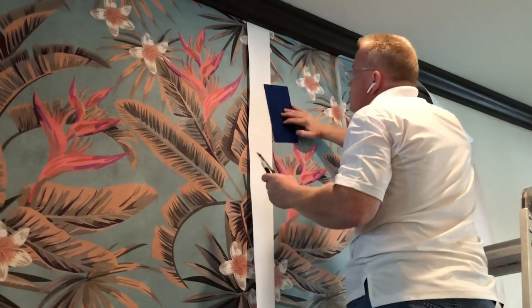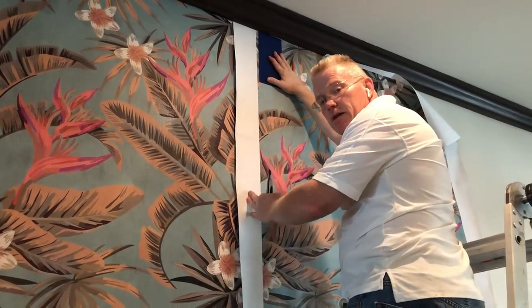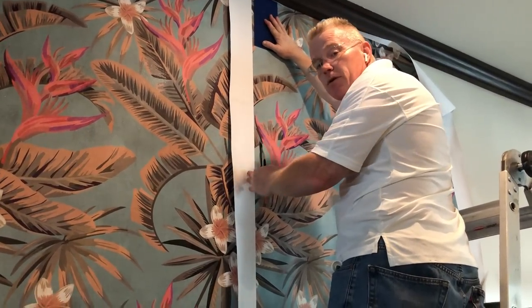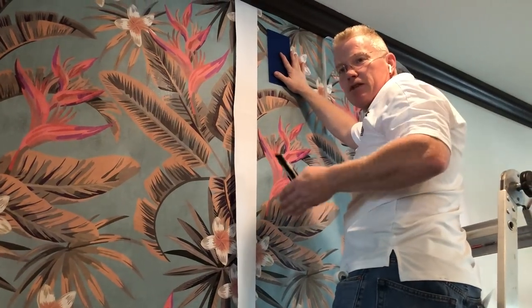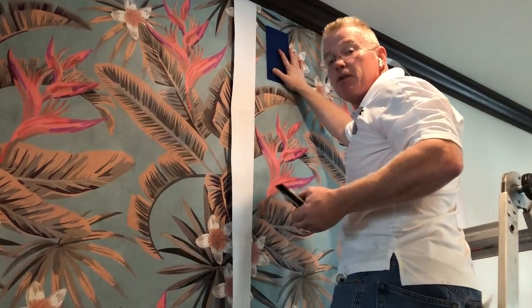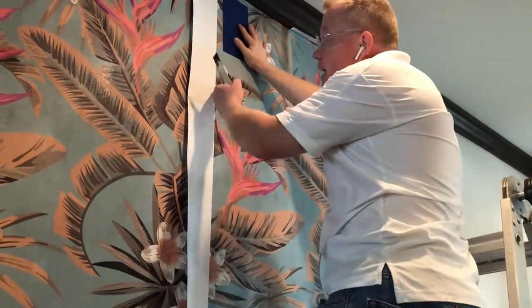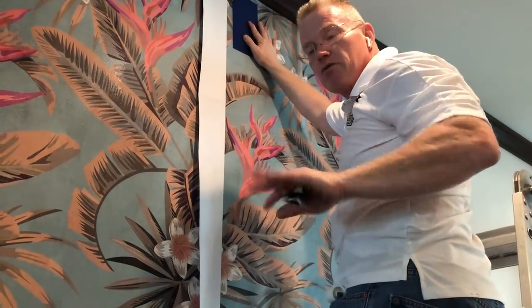Okay, now I'm doing sharply. Now, I have a laser level. I can make a laser line and then follow that laser line with a piece of tape against which I use this, and I can have a perfectly straight line. By using a template with a piece of tape that's created by a laser line, I shut the laser line off after I put my piece of tape up against the laser line, which is now a template straight line.